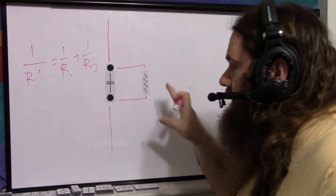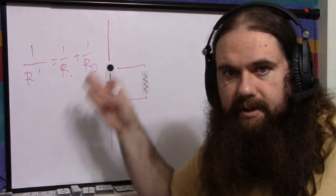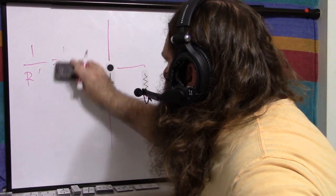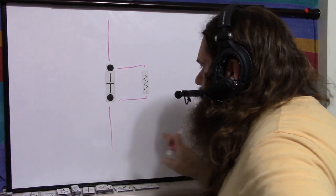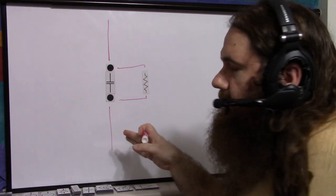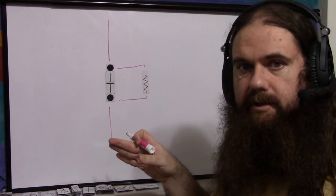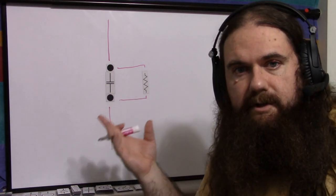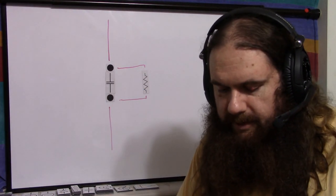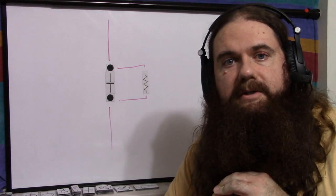So if you add a large resistor, it doesn't impact the circuit much. It's not going to be drawing much power because it's large, and it's not going to really affect how the capacitor interacts, as long as it's large enough for your application. When the device is on, it's going to be dumping power, but you make it large enough that we don't care. And when the device is off, it will slowly just discharge through this resistor, and eventually drain completely. How fast or how slow just depends on the values — it's a trade-off between power waste when on and drain speed when off.